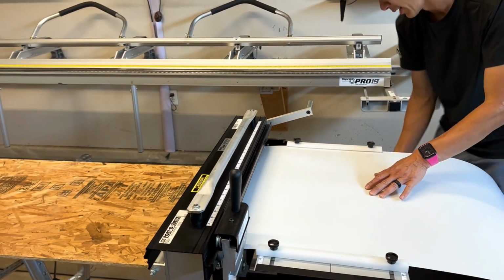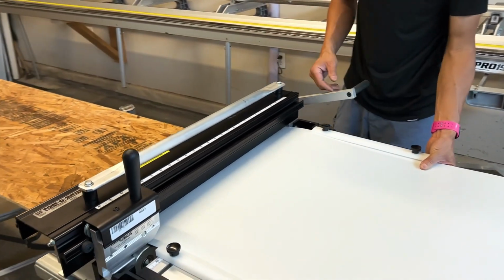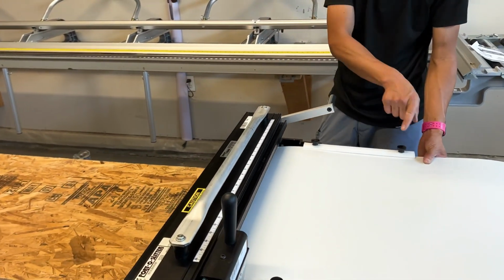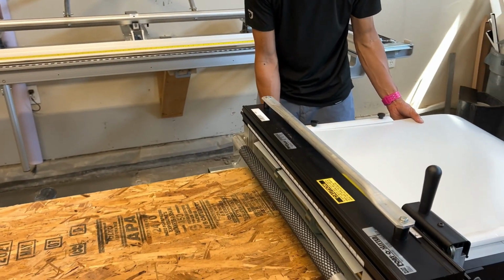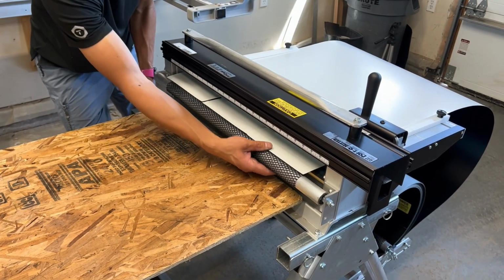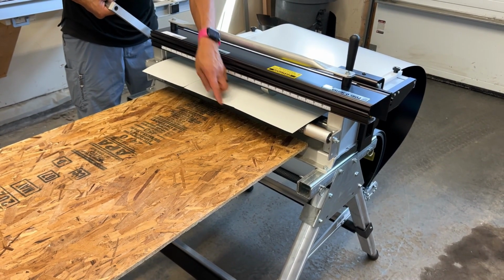And right now I have got the coil against the cutters. You have to crank the handle counterclockwise as you feed the coil through. So I'm putting slight pressure into the cutter, and once it grabs it, just make sure it goes above the roller. As you can see, this one's getting slit, and this one's creating a rib.